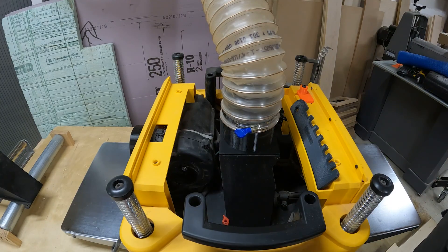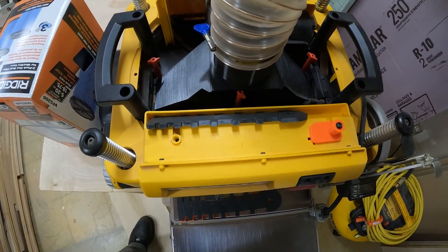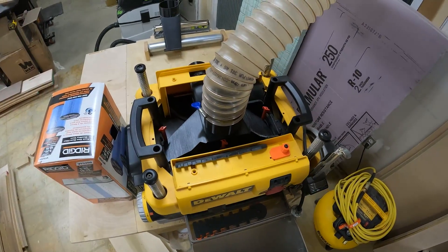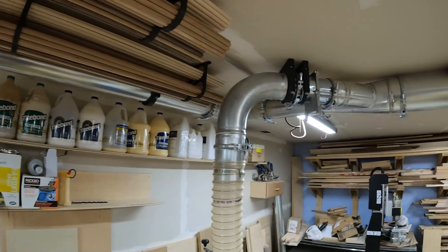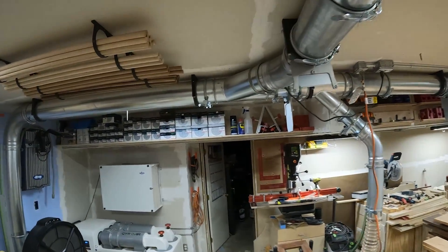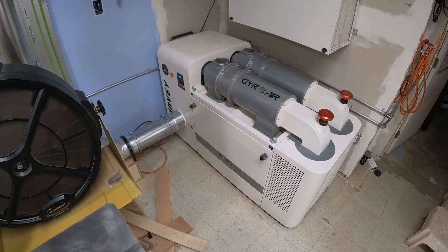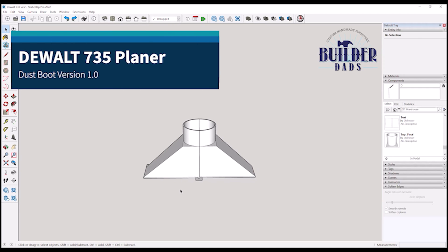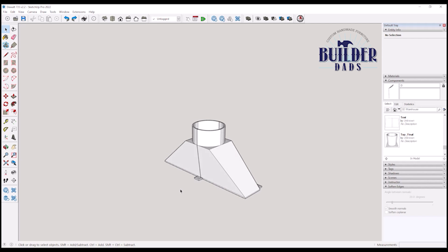That was the modifications I made for the DW735 planer. This is hooked up to a four-inch port coming off my dust collection line. The dust collection line services a few tools and comes down here, switches into a six-inch line that takes me all the way back to my Harvey dust processor — it's a G700. Thanks for watching and for a quick walkthrough of version one and version two of the design. Have fun.